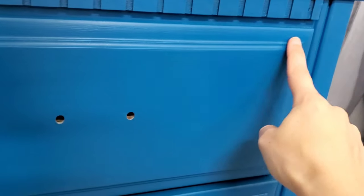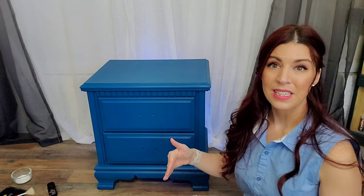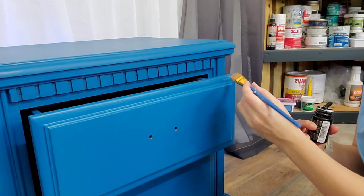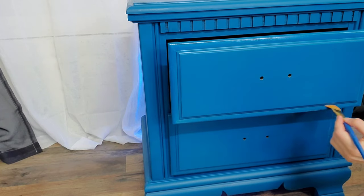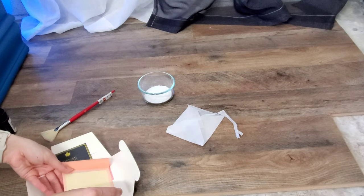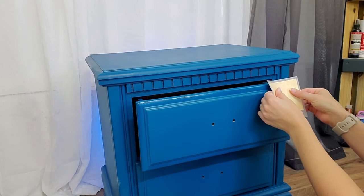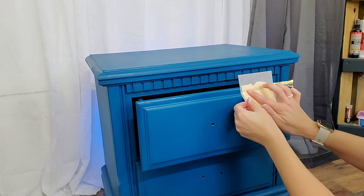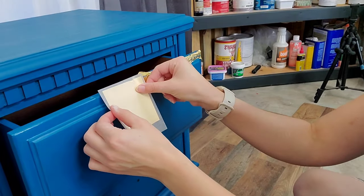One thing that's really fun and easy to do with gold leafing is to go around the frames of the drawers and line them with gold leaf. You can do this if the drawers have a framing like this, or if they sit in a bit you can frame the piece — either way the look is framing the drawers. I'll be taking the Speedball adhesive and using a small artist brush to go along the frames. Give it a few passes then wait 30 minutes for it to get tacky. I like having my gold leaf open and ready to go, taking off one sheet at a time and laying it down along the frame in repetition.